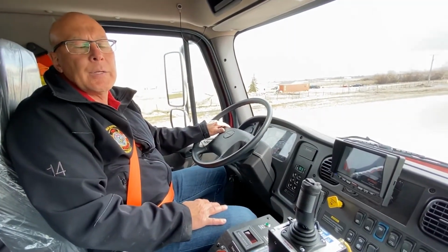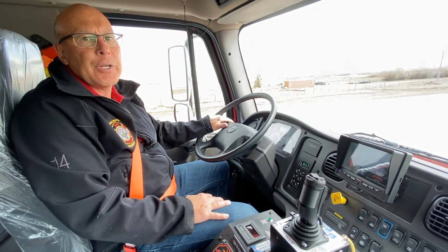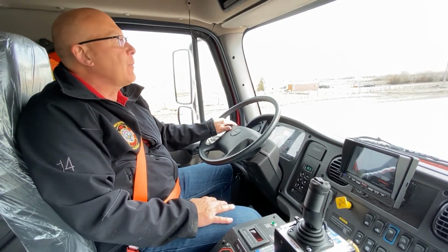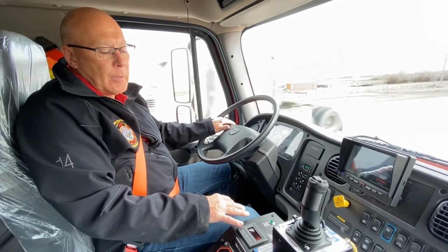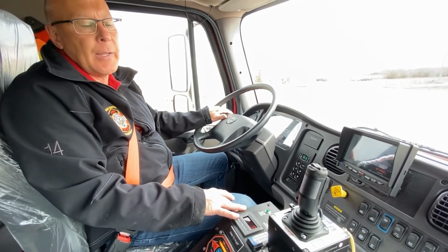The run was done in two-wheel drive only. Again, the transmission is scrolled down right to first gear. We do approximately 20 kilometers an hour at governed engine RPM. The pressure reading at the time was approximately 390 psi.